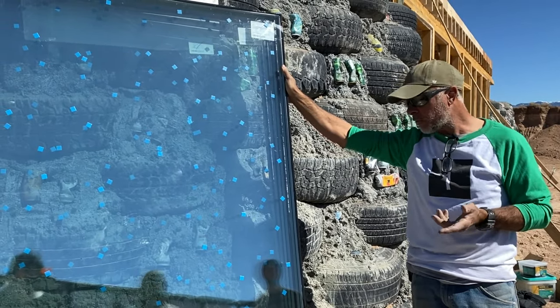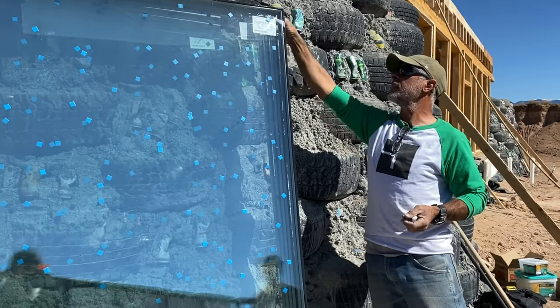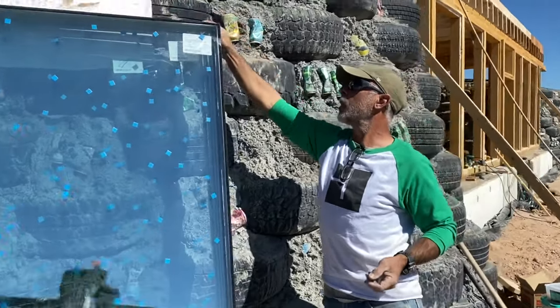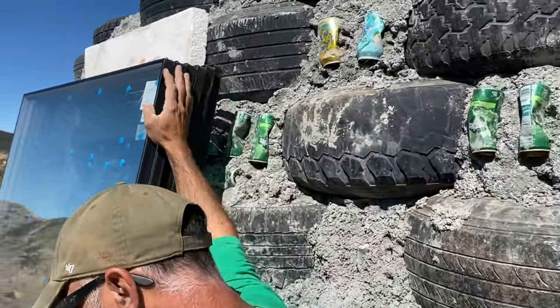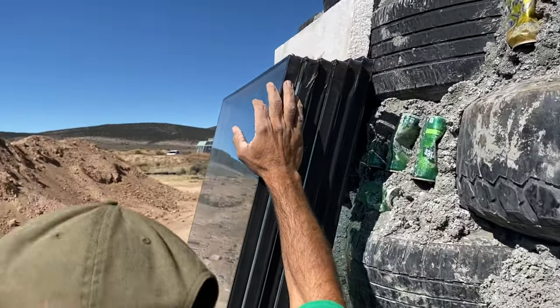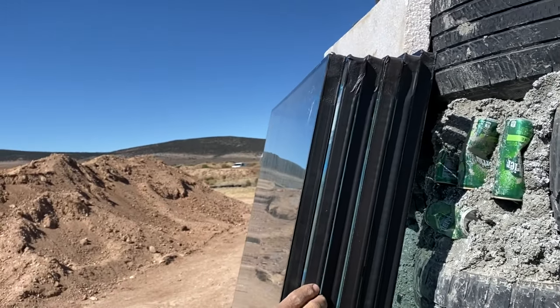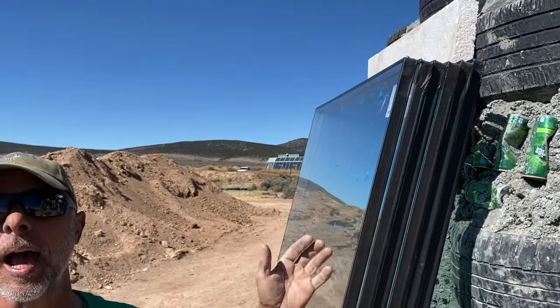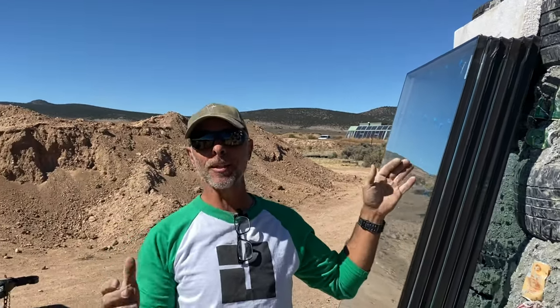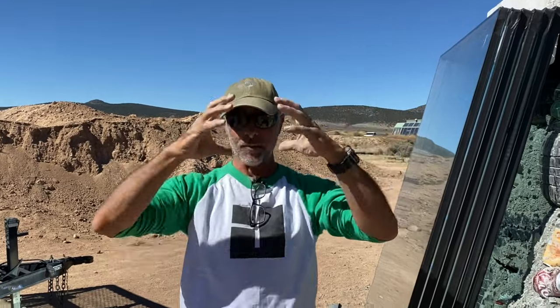So what you have with this piece of glass is a breathing tube. You can kind of see them. Here's one sticking out of the back. The reason for this breathing tube is if this piece of glass comes from sea level, without this breathing tube, you might find this piece of glass to be ballooned out like this. Because it's tempered, it won't technically break, but it can still balloon. It's a heck of a sight to see a piece of glass kind of expand.